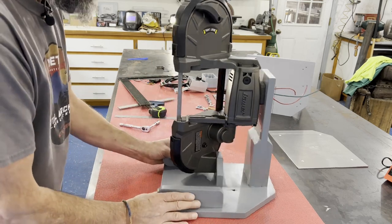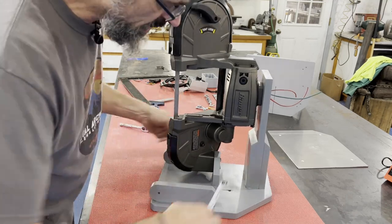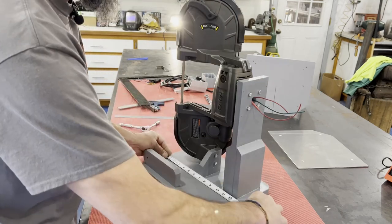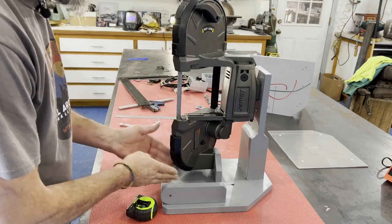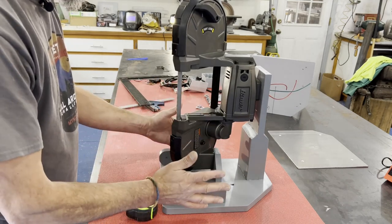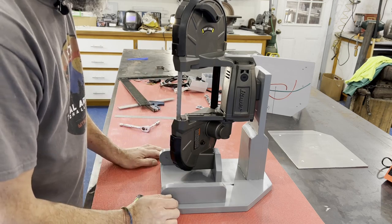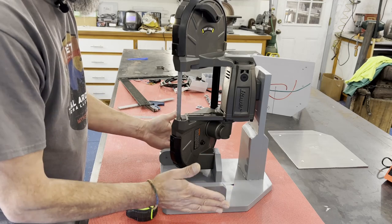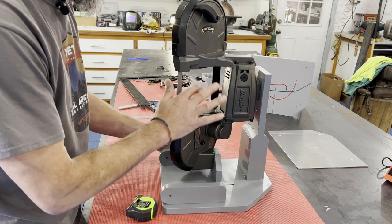Given a piece of material I had laying around, I made it 10 and 3/8 by 12 and a quarter, which I think was pretty good. This base actually measures 10 and a quarter this way and about 13 and a quarter the other way. I located the blade and determined where my table needed to be centered on the blade, then cut that piece.